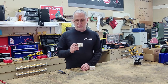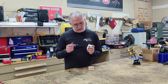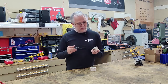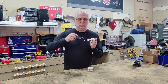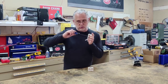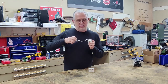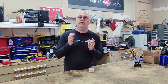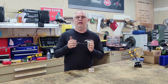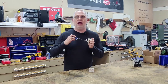One of the issues I see with people using this switch is they use it incorrectly. To turn it on and off, you use an Allen key. You turn it counterclockwise to turn it on and clockwise to turn it off, as it's labeled on the front of the switch. You can feel there's no resistance in the on position. When you feel resistance is when it starts to go into the off position, and half a turn turns your robot off. Everybody thinks they just need to keep cranking it down, but if you go all the way to the bottom, the switch itself is just plastic — you can break it.